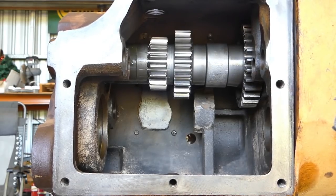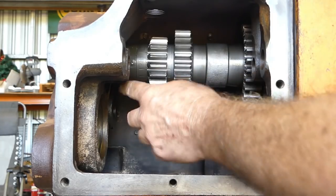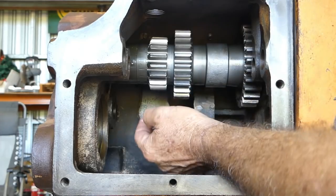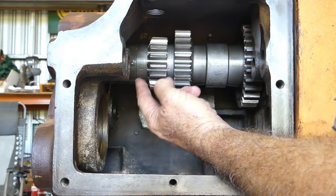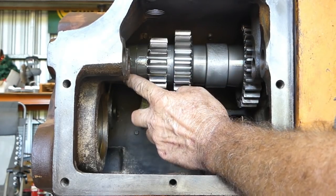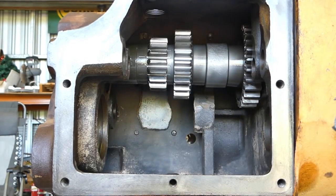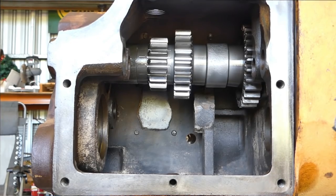At the front here, we can put a front bearing support housing on. So once you've slid the shaft in, I'll bring you around the front and we'll put this front housing on just so we can support it. Then we can turn it up a little bit, and we've got a circlip to put in behind this bearing here. Follow along, I'll get you around the front and we'll put the front housing in.